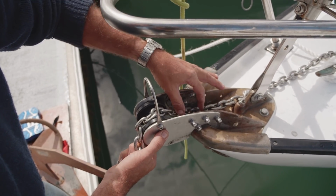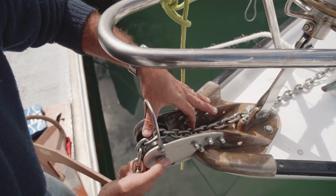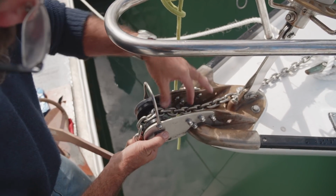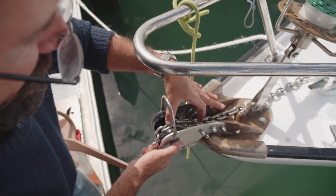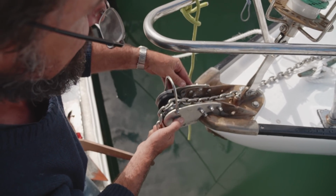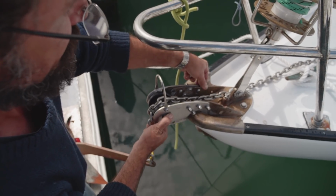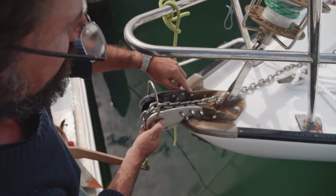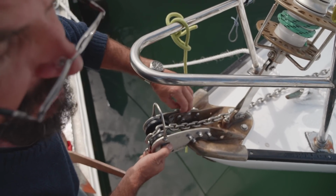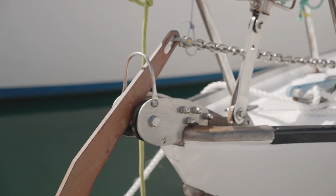It was back there. Because we've extended it out to here, we've gone to a 12mm bolt and a bigger rolling diameter for our roller, but we have increased the leverage. It is only a few inches, but we have increased it, and that's why we've gone pretty beefy. This stainless here, going with marine bronze, there's not too much dissimilar metal corrosion that's going to happen, but everything's been pretty well smeared in there with Tef-Gel, dissimilar metal compound.